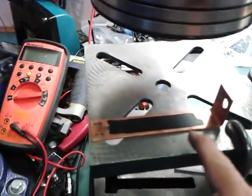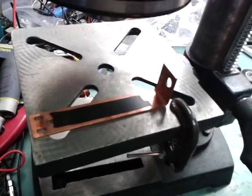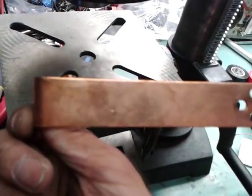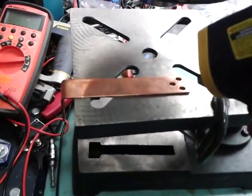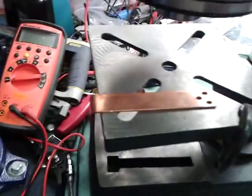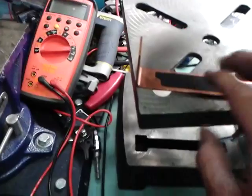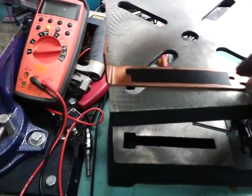I installed a black tape on this piece of metal. The reason is because when you want to monitor infrared temperature with infrared thermometers like this one, the infrared will be reflected by a polished metal part like this — it's like a mirror. So the problem is that if I point this infrared thermometer that way, it will measure the heat of the incident part right here. If I point it like that, it will measure my heat that bounces on this and reflects into this one. So if you want to measure the heat on this part, you have to put a black material that will cancel reflection and only give the temperature measurement of this part.